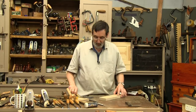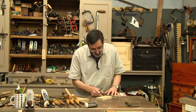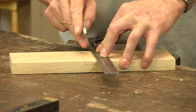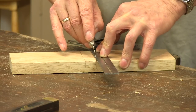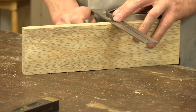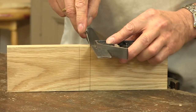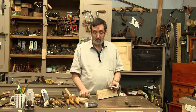We're going to chop out this center piece. The first cut I want to make is going to be on one of these pencil lines. I'm going right up with the knife and the blade of my square right up to the pencil line — actually just a hair over — so I can just see the pencil line almost underneath the blade. I make one small light pass with very little pressure, then progressively heavier passes. I'm also going to go on to this edge here just so I don't get tear-out on the outside face, and the same on this edge. One thing I want you to notice is that I am not doing anything to this second pencil line at this stage — I'm leaving that alone.